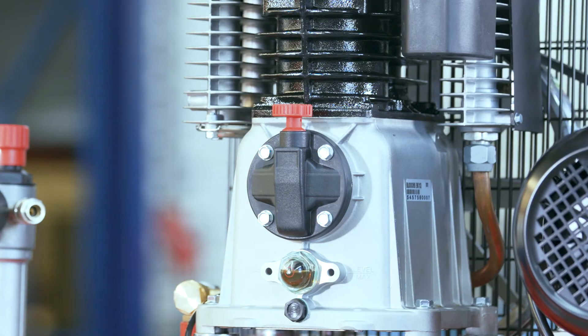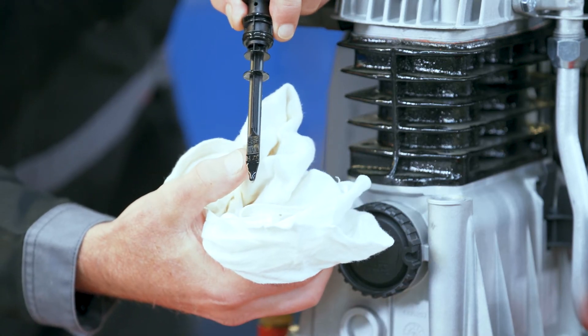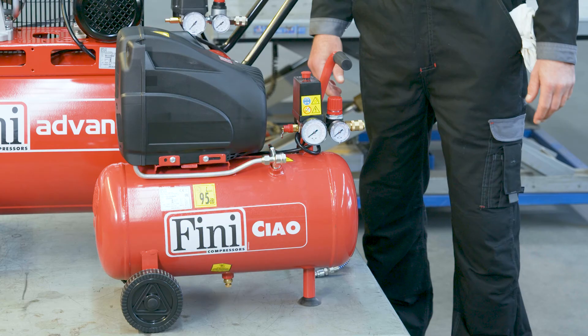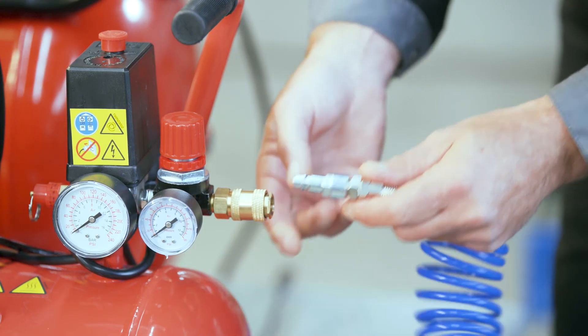Make sure your compressor is on a flat surface. If your compressor uses oil, the first thing you do is check the oil level. Find the oil sight glass or dipstick near the bottom of one of your compressor's ends and use it to make sure that the oil level reaches the right level on your dipstick, right between the two markers. If your oil level is low, check the owner's manual to see what type of oil you need and pour some into the proper tank. Locate the regulator valve, which should be right next to the smaller pressure gauge on one side of the compressor.